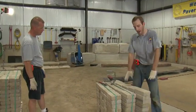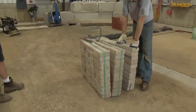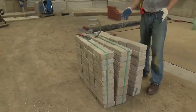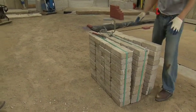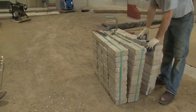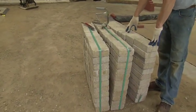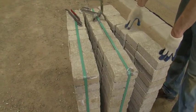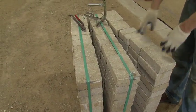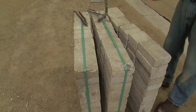Because this is a tumbled product, we don't have to worry about blending different pallets of pavers together. The blending is already done at the manufacturing plant before they come to us, so that whole step is taken out. This also is a random product, so we have a random distribution of three different sizes. They're already picked out and the ratio is picked out for you by the manufacturer, so you don't have to worry about that, except for the fact that you use each of the three pieces equally in the project.